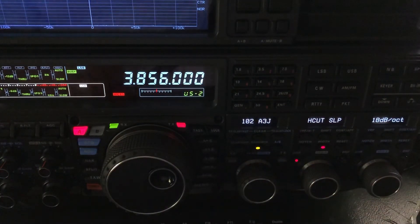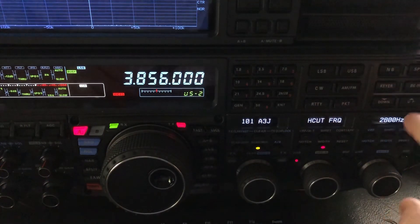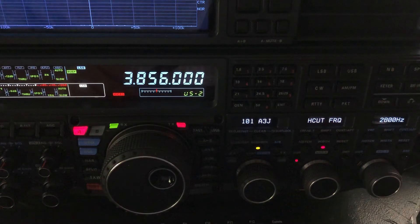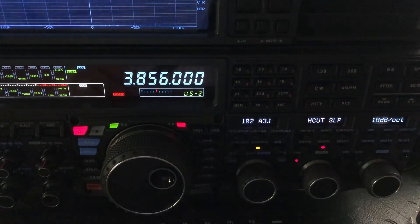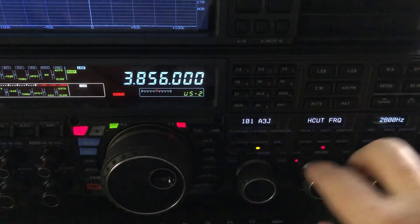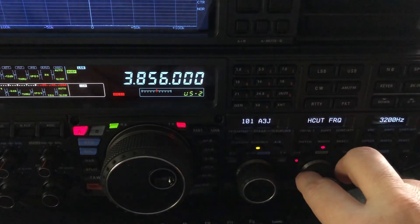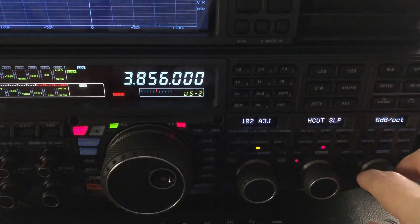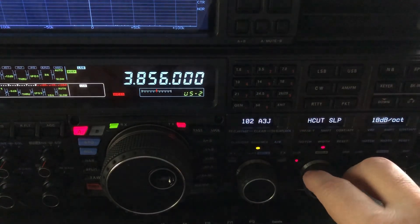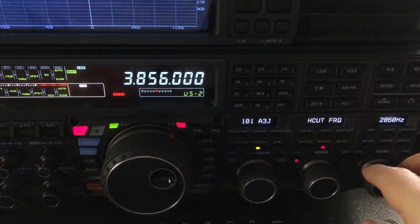In that scenario, you might want to set the high-cut to 2800 Hertz and then use the brick wall — 18 dB per octave. What that means is that by the time frequencies of 5600 Hertz are coming out of the speaker they've been cut by 18 dB. I usually run at 3200 just because of my high-end hearing loss, but I highly recommend running 18 dB per octave and dropping to about 2800 if you can get away with it.